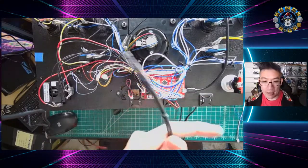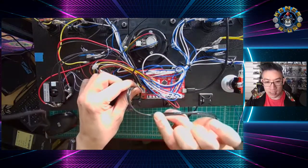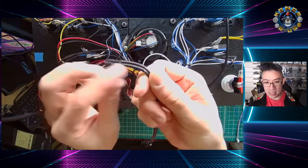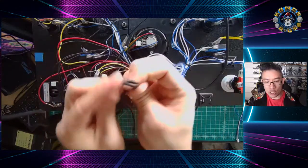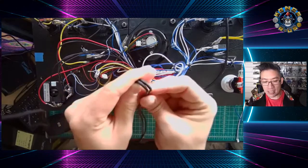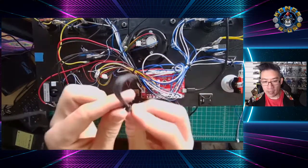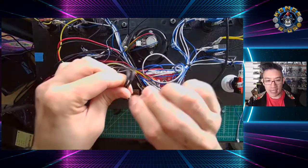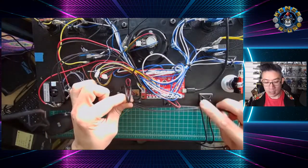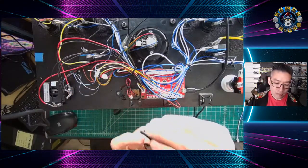Okay, and to prep this wire, what we're going to do is plug it in, and then I'm going to bend it down and across this way and zip tie it down. So the first thing I'm going to do is bend this connection down like a U, right where the heat shrink tubing ends, so I can make a little U shape like that. Then the next thing I'm going to do, right where that U bend is, is make a right angle bend so I can start to zip tie it down along the ties that I just made. So once you do this, then you can start plugging it in.